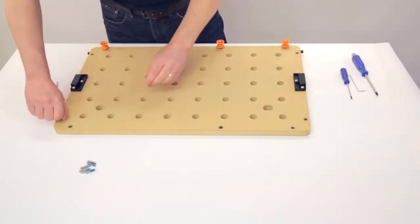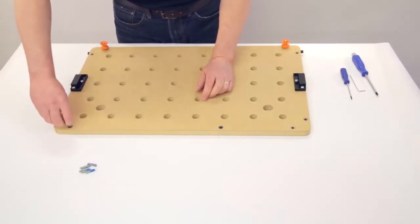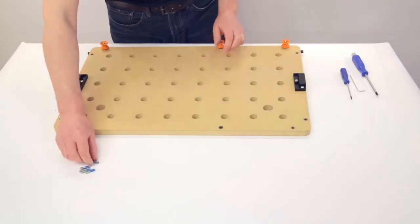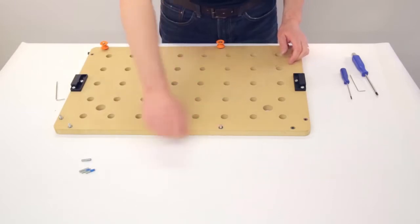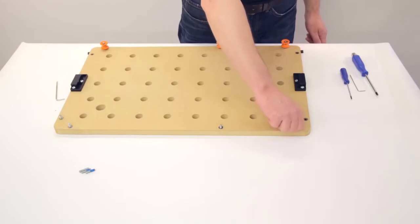Next, fit the remaining levelling pins around the edge of the clamping module. There are 7 in total. Use the same process as before, setting the pins a little below the surface ahead of levelling. They may be a little stiff to wind down because of the anti-slip compound on the thread of the pin, but this is quite normal.